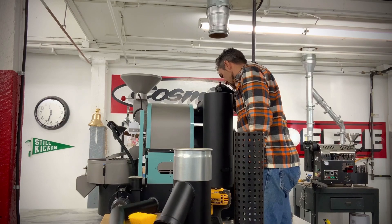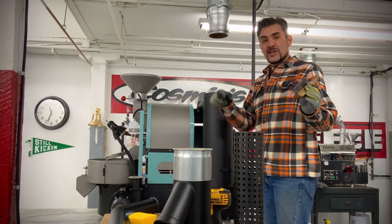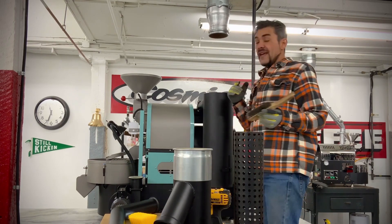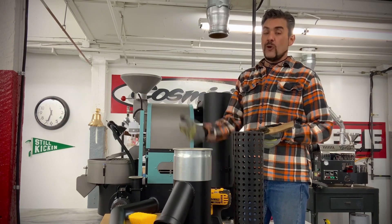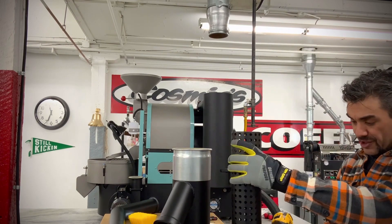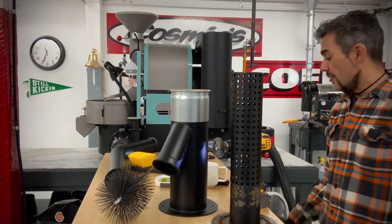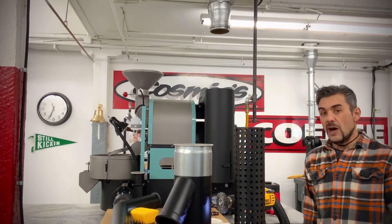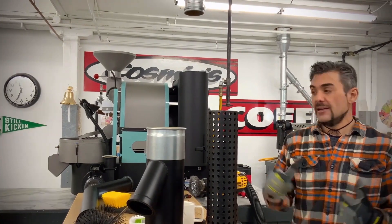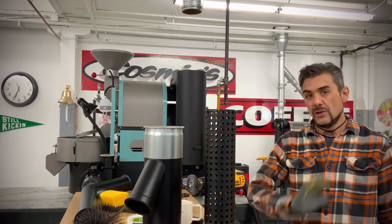I'm going to take my metal brush — the metal one's a little easier — and just scrape off this little drift of fuzzy dust, basically like a snow drift. That's all I have, and cleaning that will prevent it from building up as quickly moving forward. I might even use my drill to make it a little easier, then clean this up nicely and put it back. This probably won't take more than five to ten minutes, and then I'll be confident that my roaster system is healthy, my cups will be consistent and clean, and I don't have to worry about the machine being overworked or a fire risk. The new one-and-a-half K lab roaster is really easy to take apart and diagnose — we'll see you guys next time.